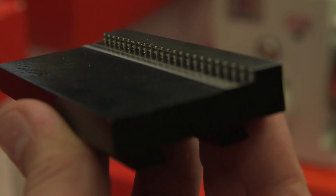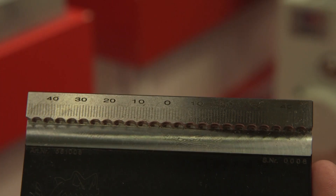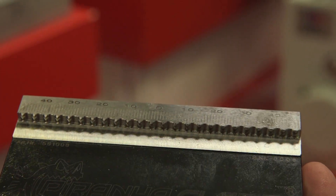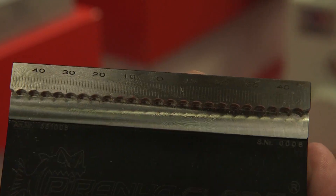They have a double row of hardened serrated teeth, and this certainly eliminates vibration. Those teeth — you mentioned the height of the vice itself is 35 millimetres — but the teeth themselves, how high are they? Three millimetres, so we just need three millimetres of the workpiece to hold on to. Okay, so essentially you can get more on the billet? Yes, indeed you can.